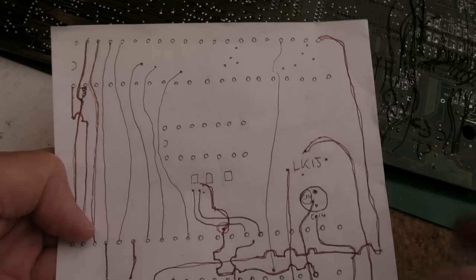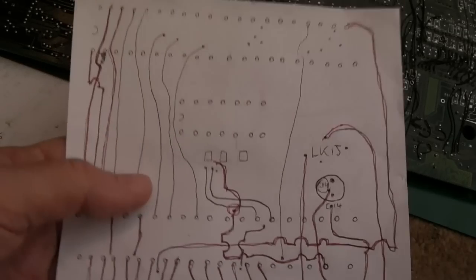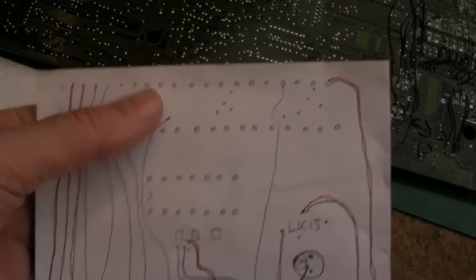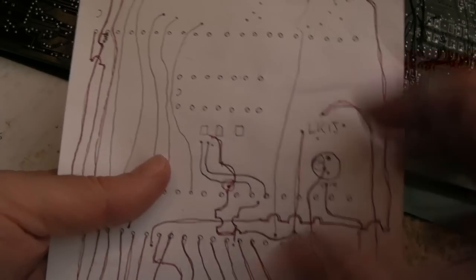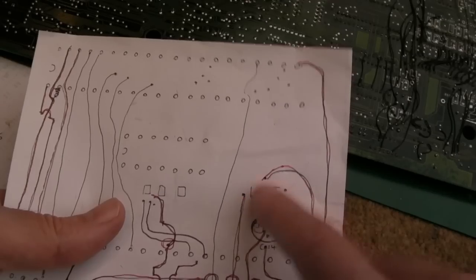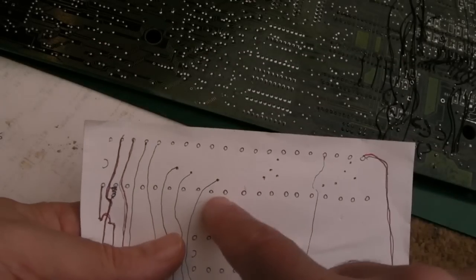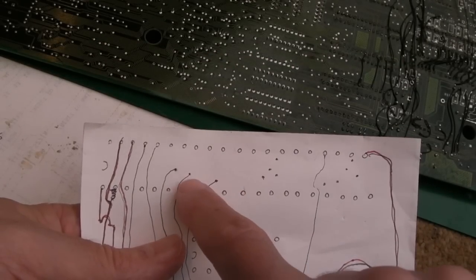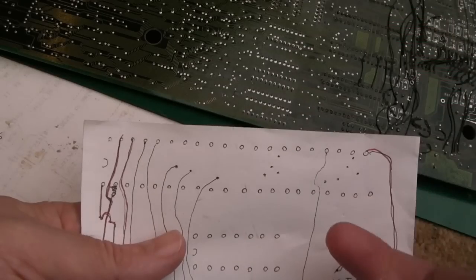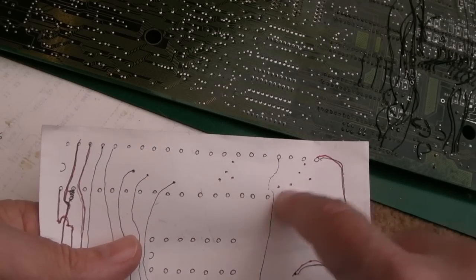And then a couple here, one up here goes all the way down to a via. It's important that you draw vias in the same patterns they are, in the right locations. This is why I had to draw the whole lot like this, and try to get things proportional. So these patterns of vias around LK15, for example, are exactly how it looks, and it's the same here. You've got two, and then two sort of offset, and the same up here, vias in between the correct pins and approximately the right stepping height as those three go up that way, so that when I flip the board over, I can see the same sort of pattern going the other way, if that makes sense. That's why I've drawn these here as well.